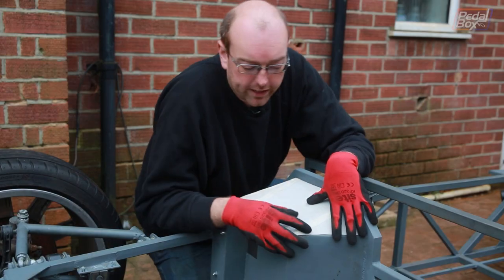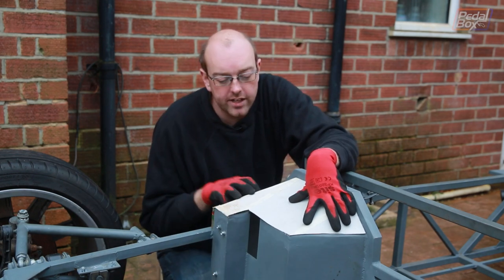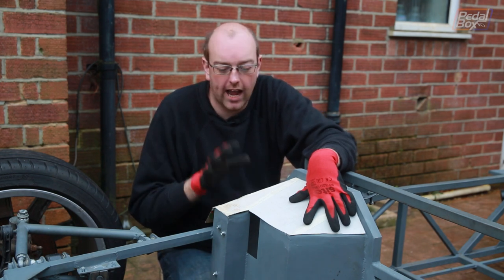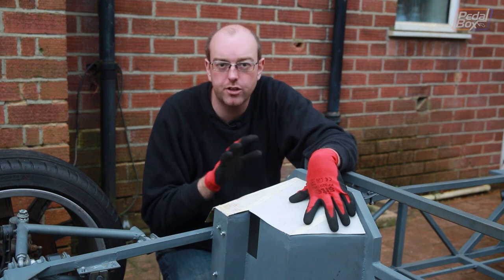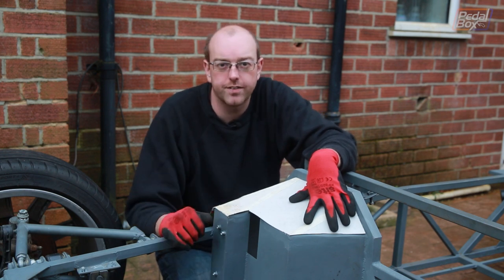The template was made slightly bigger when it was cut into the metal, and we just resized it to fit, really tailoring the final fit and finish when we put the metal panel on. It was slightly bigger in the end just so we had a little bit more room for error, which we inevitably had, but this gave us a very good position to work out what we needed to cut, where we needed to bend, and how we were going to make up the panel to fit properly. Of course there's a lot of test fit and finish as you put each bend in to make sure your marks transpose correctly, but that's the nature of the game.